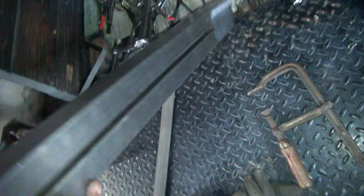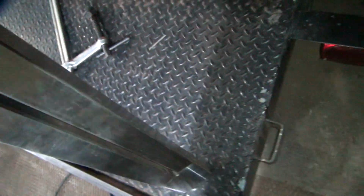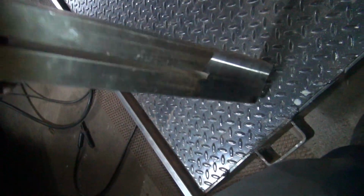Slip right in there like you're supposed to right now. Get all the way down. Alright. So we got that part. Alright. So a lot of filing to do down in that corner, a little bit in this one too. This was the hard one, that's the easiest one. That's because I cut an extra 10 thou on these things.